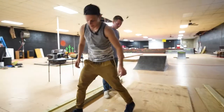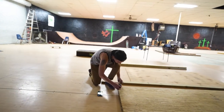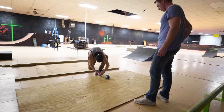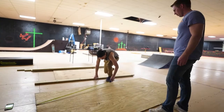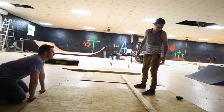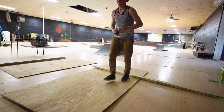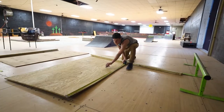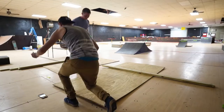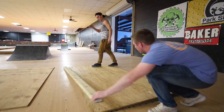This sheet is already 48 inches wide, so I'm going to mark 66 here. The side pieces are going to be triangular — 60 inches long, 18 inches high, and one inch tall on the bottom end. So 18 inches here for the height, 60 inches this way, one inch tall. If I've done this correctly, from here to here should be 62 and a half — yep, that's 62 and a half. Got to use my geometry skills here; it's been a long time. Those are our two sides.